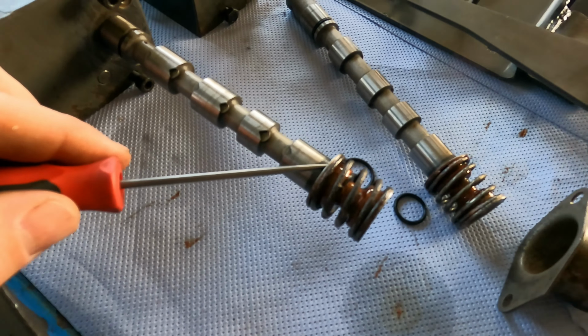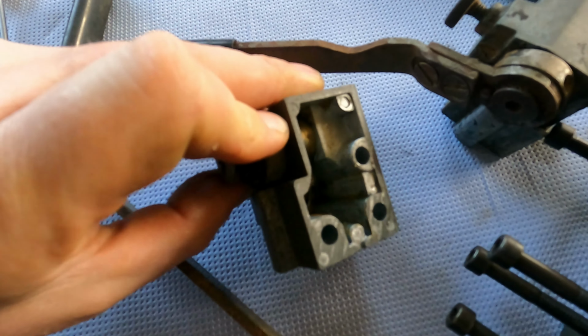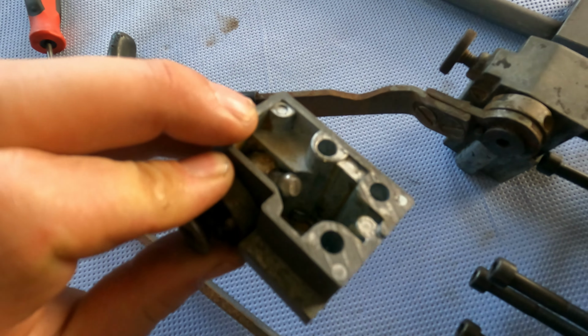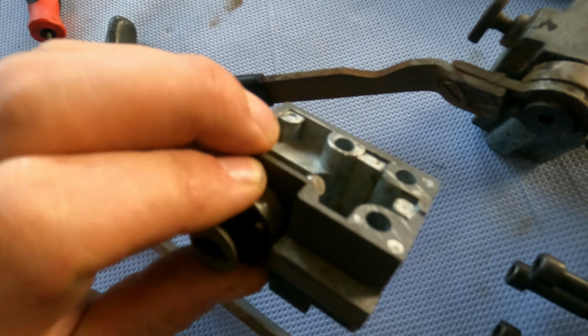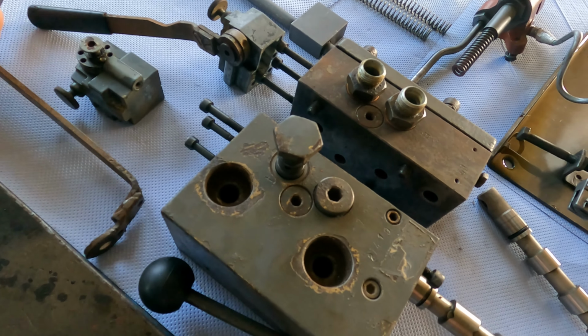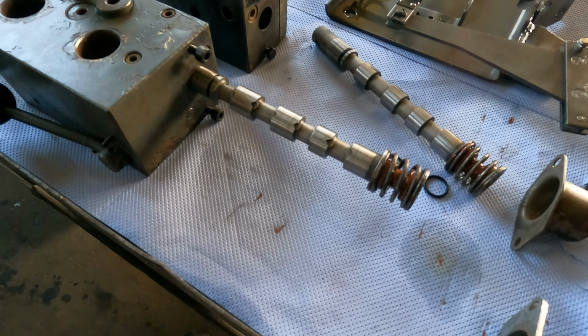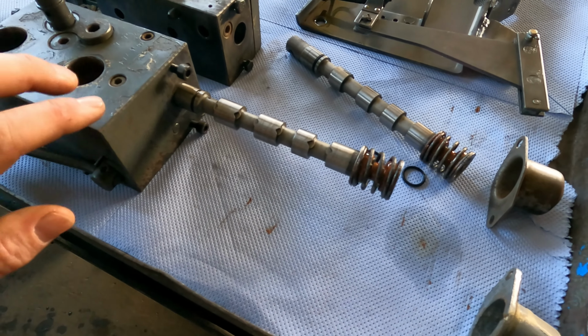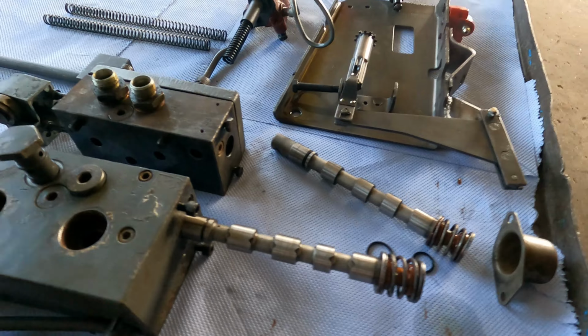And the majority of people think that when they're pulling, the lever is joined onto here, and inside there is, if you can see that, yeah, here's a little ball. That's the ball that sits inside the valve. Basically, you usually end up bending the lever, as you can see, and people think, oh, something's severely knackered, or they don't actually realize that it's a double acting valve, and they think it's just a single acting valve.